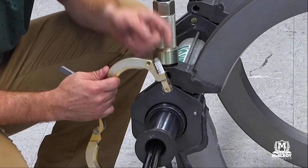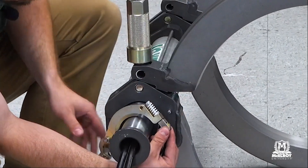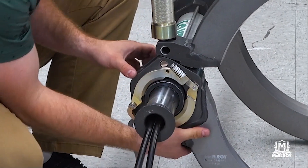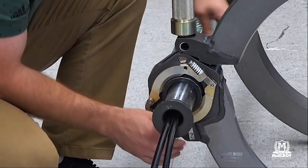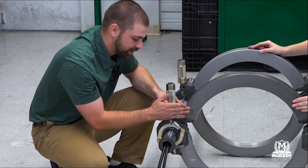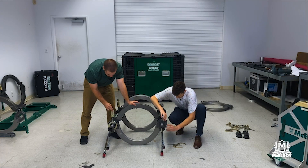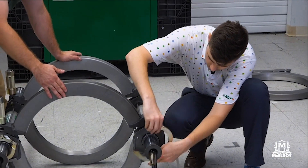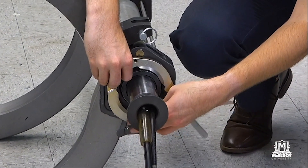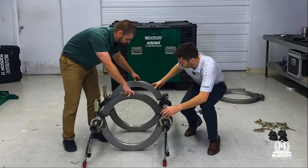This little white spring is always going to face the top middle of the carriage. Take a clamp, bring it together to form a circle, then bring this little lever arm down underneath and that's going to clamp this half of the jaw onto the guide rod. Robbie's going to do the same while I support the carriage. One big piece of this is to make sure that your jaw is square and butted up completely against the cylinder, which we'll show you in just a moment. If you ever find yourself struggling to get the clamps on there, most likely your jaw just isn't fully seated up against the backside of that cylinder.